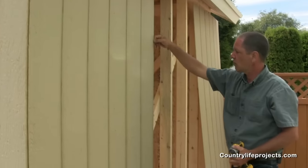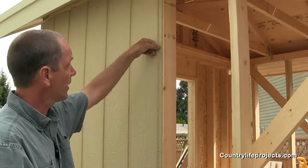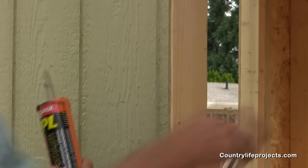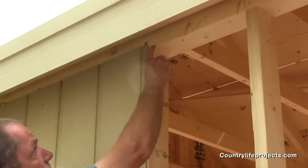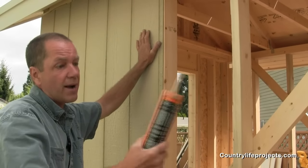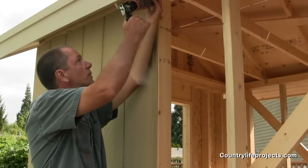There's one more thing I'll be showing you, and that's how we're going to put our glue on and do the next panel. We start our second panel — this is already glued in behind here. We're going to have to put a bead of glue on top here as well to make sure the panels are all binding together, and it helps ensure that the lap joint doesn't lift later on. Also — because I didn't outline this clearly enough on the first sheet — these panels come up 3/4 of an inch onto the first top plate. So your glue, you want to have on the lower part of that plate. When you do your last panel, cut it about a quarter inch back from the end so that you're not protruding, because that'll interfere with your trim in the final stages of the shed.